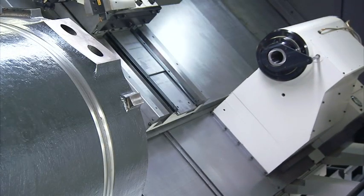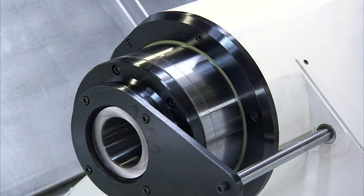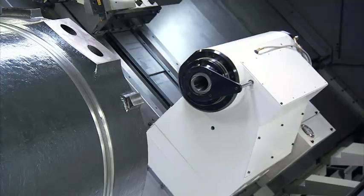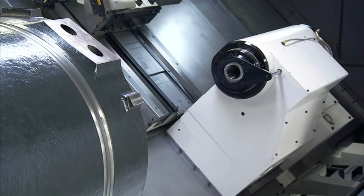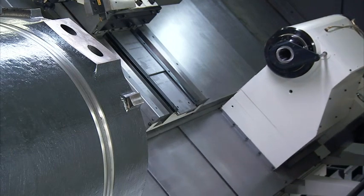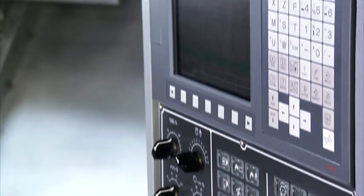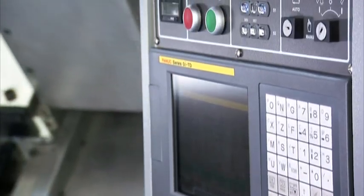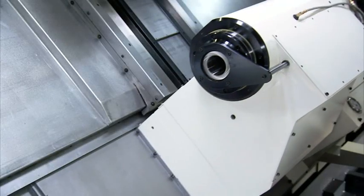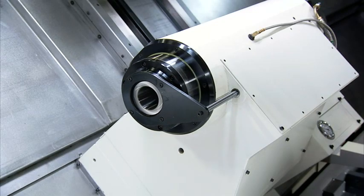The massive tailstock in the FBL-530MC is specially designed for ease of use and heavy load support and incorporates a modern quill-type assembly, 200mm in diameter, to simultaneously support and rotate with large work pieces. With this machine, the user operates a hydraulic motor drive mechanism through the control panel to easily and efficiently move the large tail stock into position, eliminating the need for manual positioning and reducing setup times.